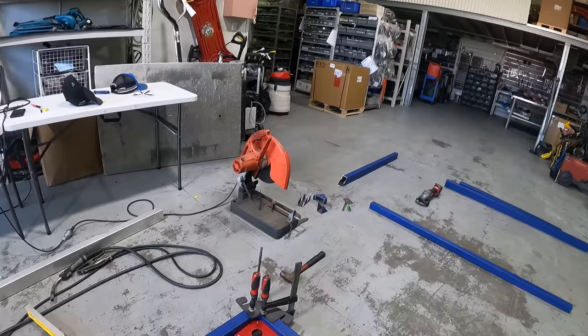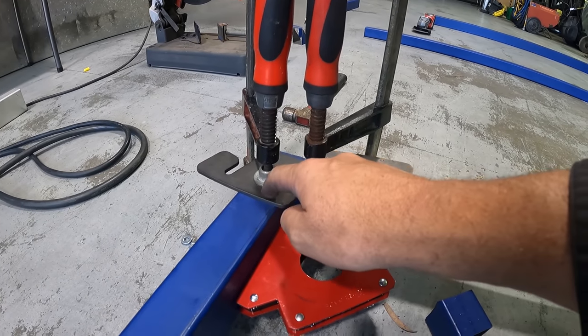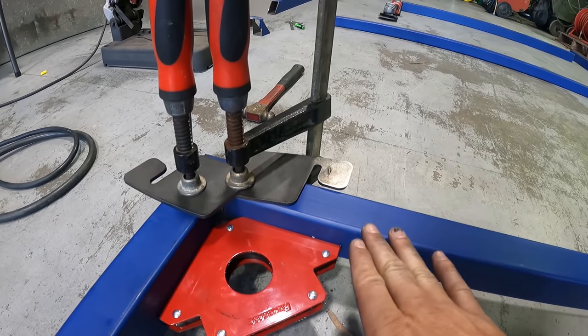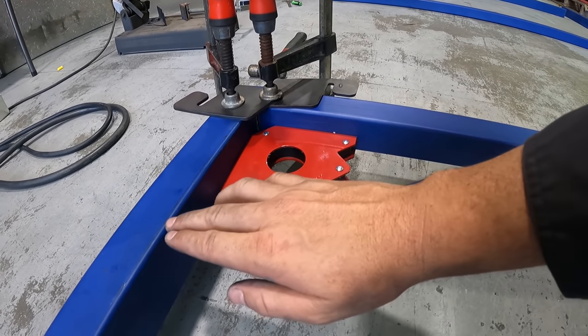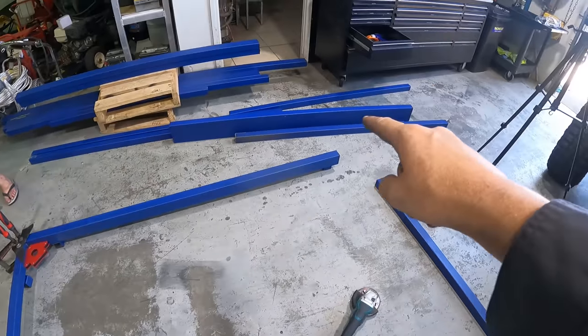We're almost at the stage for our first weld. What we've done, instead of building it off the ground, is put something flat across the top. This is just some old cutout steel. Then our 4mm packer spaces that down 4mm, which will allow the floor of the tray to sit flush with this rail here. We're perfectly square on both sides, and we've checked the measurement from there to there and vice versa.